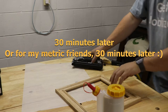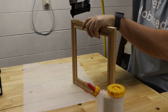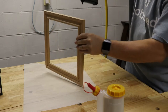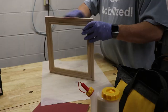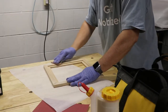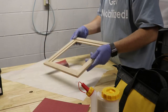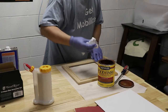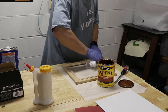Okay, so once the glue had dried, we went ahead and put pin nails in each of the corners. If you've never seen a pin nail, it's basically very similar to a brad nail, but the head is almost non-existent so it disappears very quickly. Once the pin nails were in, we went ahead and did a light sanding — I believe this was a 220 grit or a 400 grit. After the sanding was completed, we cleaned it up with denatured alcohol and then used a Minwax gun stock stain.